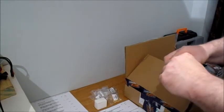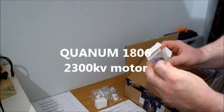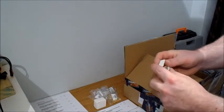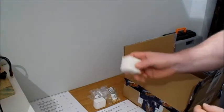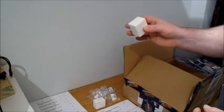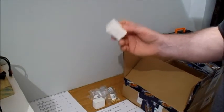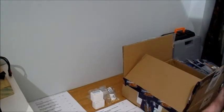I also got the 2300KV version as well, so can give that a try. There's a plane in mind I've got to try these in. These are capable of running 4S but the plane I'm thinking of putting them in - I wouldn't be able to fit a 4S battery in it because of weight and size issues. So I'd be running 3S and I want something that will turn a decent prop on 3S but still be small and light.